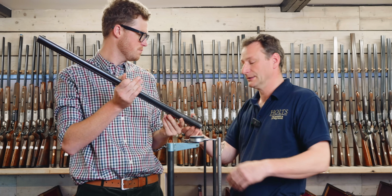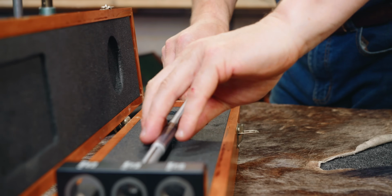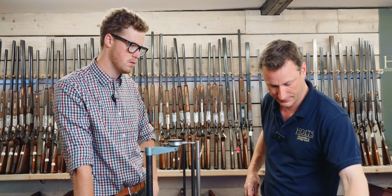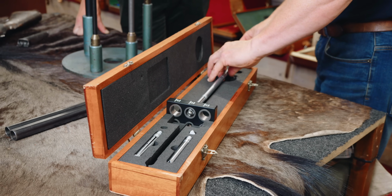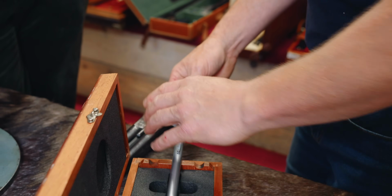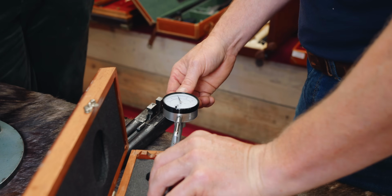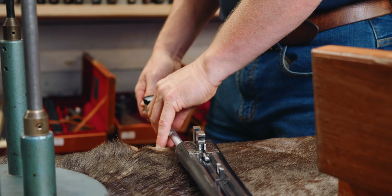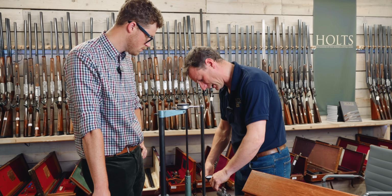Correct. Measure it up. Okay, so first thing first, we would check the dial by setting our gauge first, and we set it to 729, which means going to just touch tightness, and then reset the dial to exactly 729. And we do the right barrel first, into a depth of 9 inches from the breech, and that's 733.